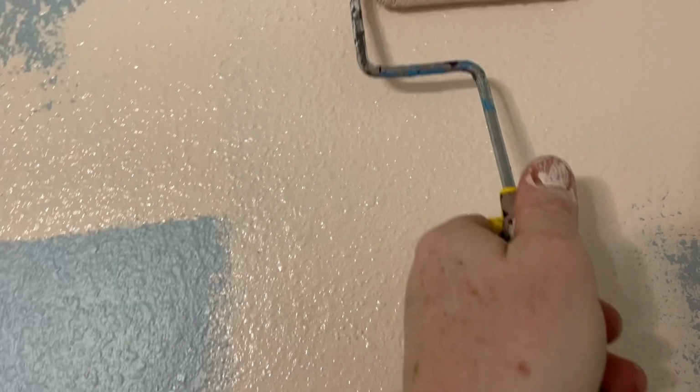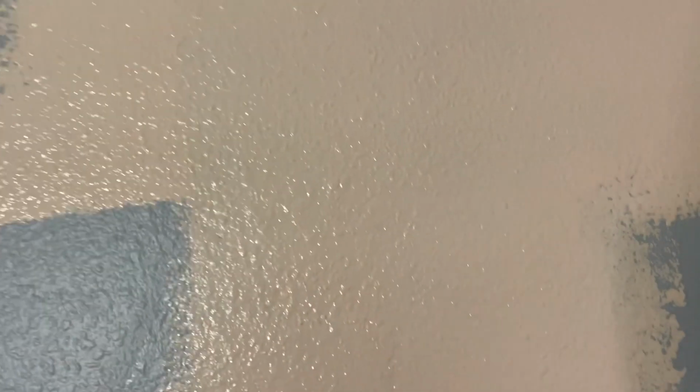And that's why we're using 3 applicators near the top. The brush to get into the corner where the crown meets the wall, the roller to create the stipple effect, and the 9-inch roller so that we can get it done in one day, right?